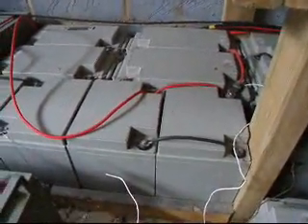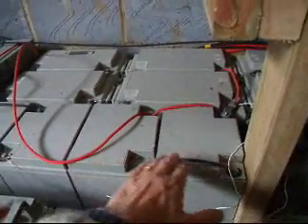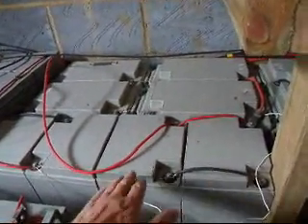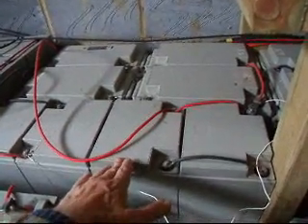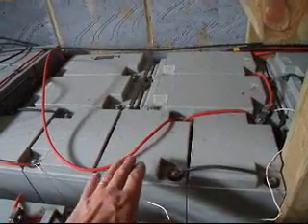To avoid the sort of problems of that battery bank last night, which went to 24.5V and then up to 25V — in order to achieve maximum use of space, I doubled up on a couple of these batteries. These ones happened to be rather older, and I discovered these batteries have a lower settling voltage. So these are actually pulling the whole battery bank down, and those have got to be changed.